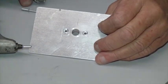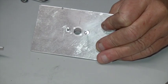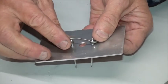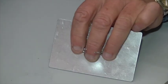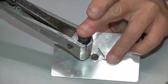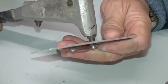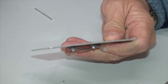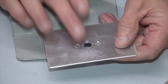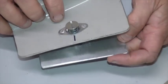Now to fit the spring — we've got 3mm countersunk rivets. Pull the rivets — the spring is fixed. We've got the spring mounted on our inner panel and the quarter turn fastener mounted on the outer panel. Put the two together.